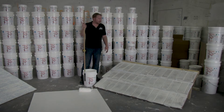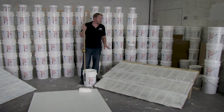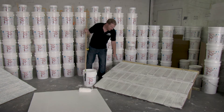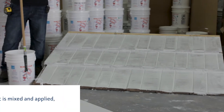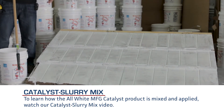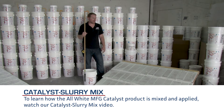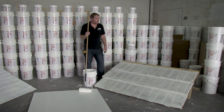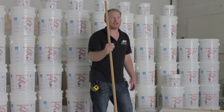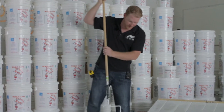Now we're going to be applying our first coat of R400 rubber across the tile roof covering. We've already got our sealer application across this roof and we've also got our Portland cement slurry mix to make sure that it's a solid workable base and everything is sealed together as one piece. The goal with any waterproofing project is to turn the roof into one solid sheet of rubber with no open penetrations or open seams that could possibly leak in the future.